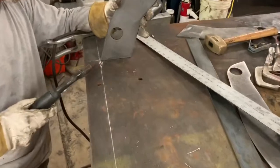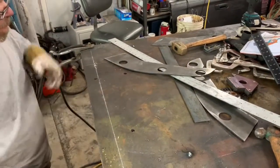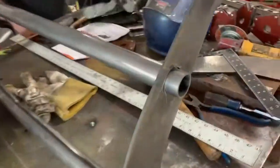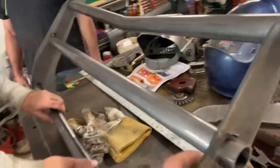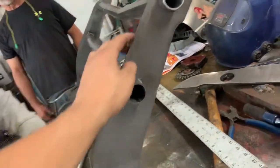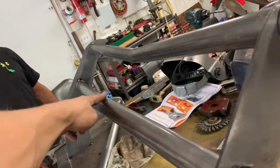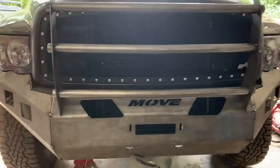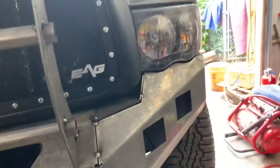We've got our bench here and we've measured 35 and 3/4 inches across. We're actually going to tack them real quick to the table, and that's how we're going to get this in place — we'll just break the tack and put it on the truck. We went ahead and leveled each side; for us it was 7/8 of an inch, but on your truck it might be a little different. We used a tool to make it perpendicular coming out from here, because this is going to be flush and plumb with the truck even though it's on an angle. Then we're going to use a bar to match the other two bars so they're all at the same angle. All three bars look nice — we've got it tacked up to the bumper with a couple inches on each side.